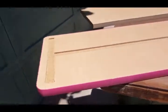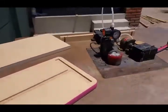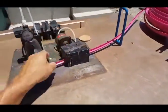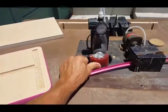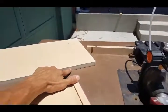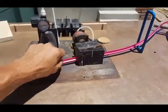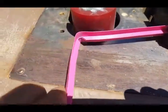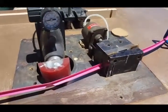You see it a lot in commercial applications — doctors offices, schools, daycares, things like that. It works really well on radius corners, but you can actually use it on 90-degree corners as well — something a lot of people don't know. If it's modified the way this one is, you can use T-molding on a hard corner. The way it works: the hammer applies pressure and hammers the T-molding into the kerf. The flush cut cuts it off straight, and the kerf cut — you punch the foot pedal — creates a kerf that lets you make that hard corner by eliminating the rib and tightening it down.